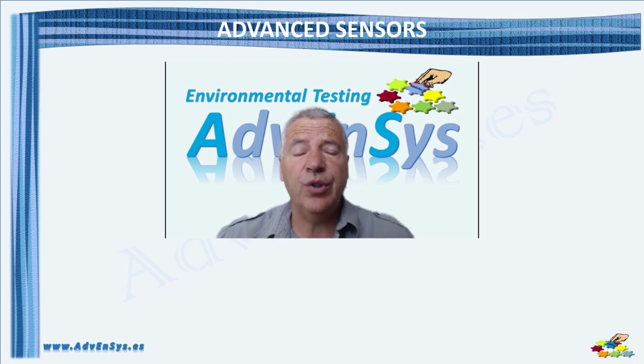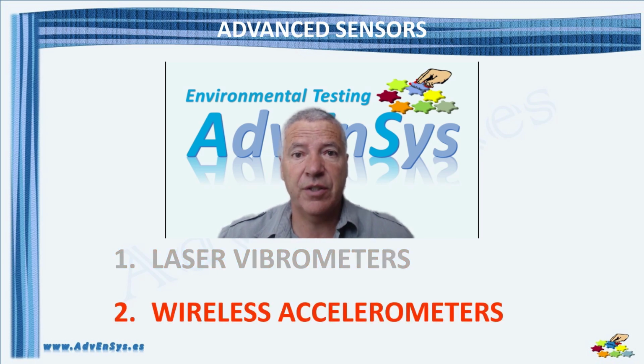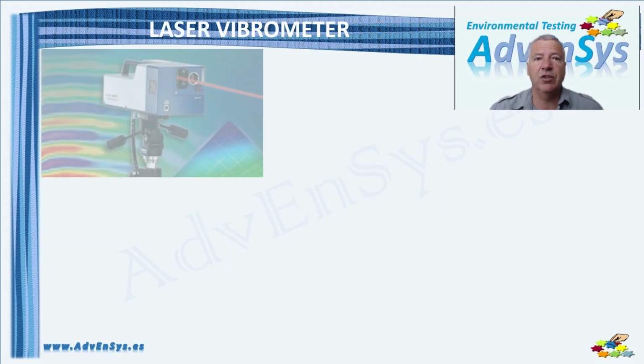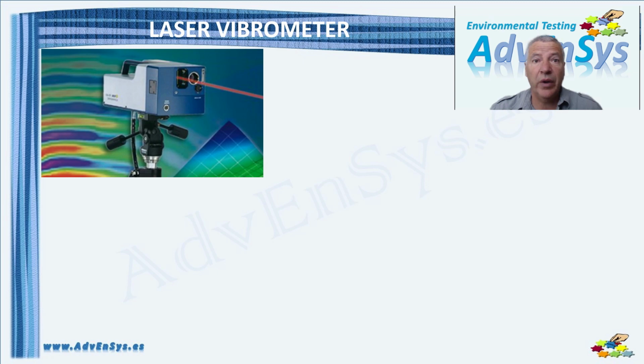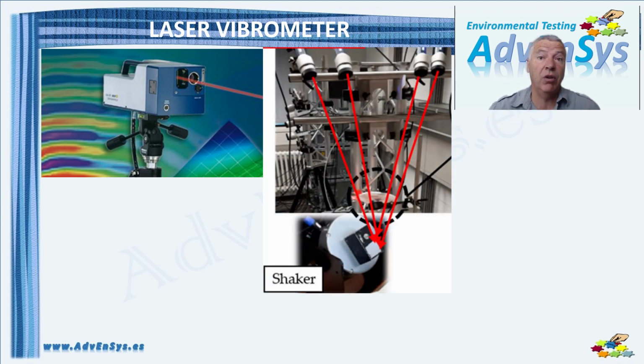Today we are going to talk about other vibration test feedback sensors different from accelerometers, like laser vibrometers and wireless accelerometers. One possible use of a laser vibrometer is vibration testing control. There are some applications where an accelerometer is not the most suitable solution for vibration testing feedback control, and a non-contact sensor, as a laser vibrometer, can be the best choice.